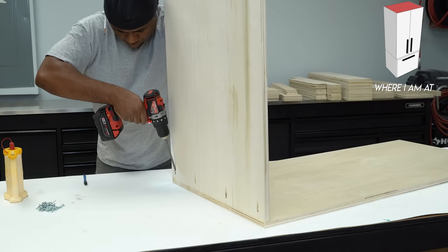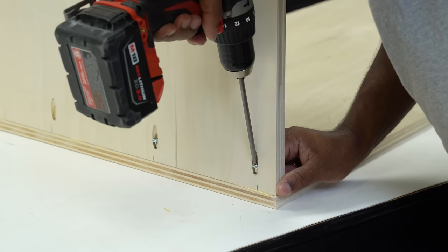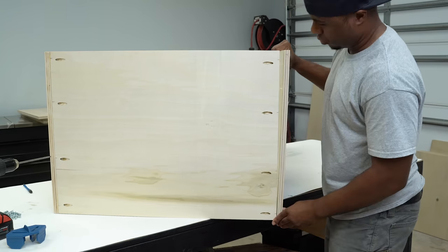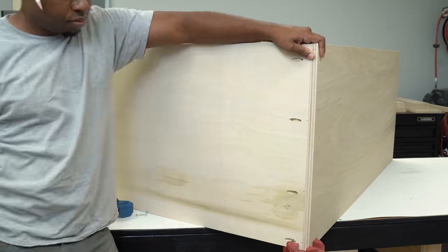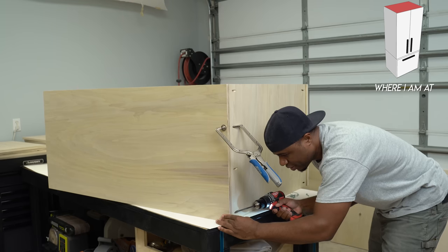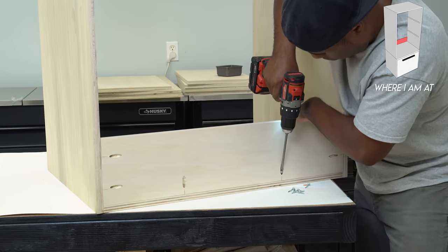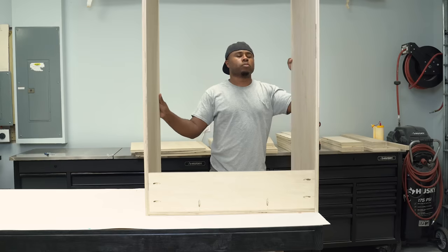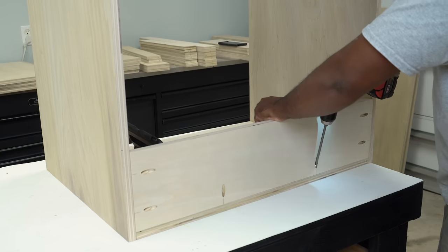This storage cabinet is made up of two parts, and this is the top. When you're building cabinets or furniture with pocket hole joinery, the goal here is to keep the pocket holes hidden. Instead of wasting an entire sheet of plywood filling in the back panel of these cabinets, I cut smaller sections used for the back end, which is how I'm going to mount the cabinet. Once the cabinet is mounted, I use 1/4-inch sheet of plywood to fill the back end.